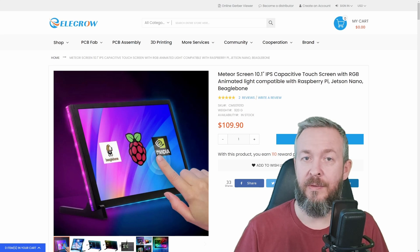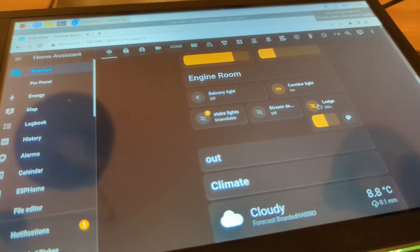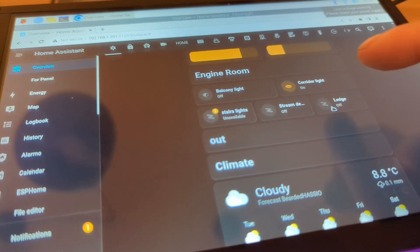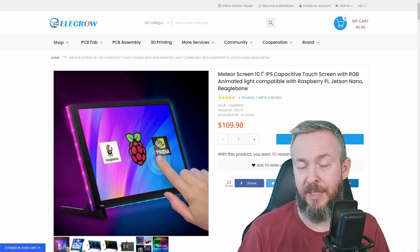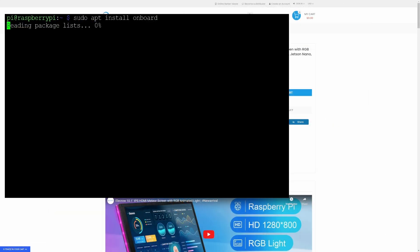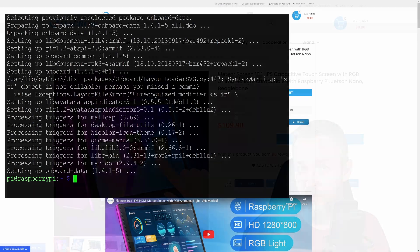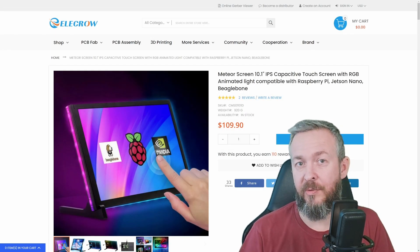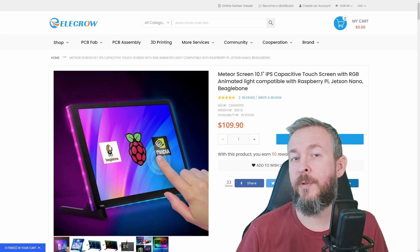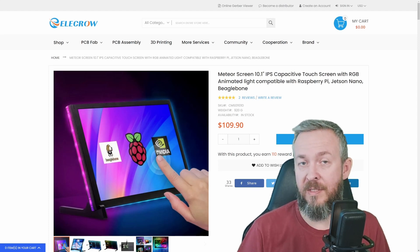I did manage to run this display with the Raspberry Pi Zero 2 W and it loaded up nicely. If your intention is to use the display with Raspberry Pi OS, it will work out-of-box — the touch functionality, even the long-hold or right-click option, yes, out-of-box. The only thing you will need to install is some kind of keyboard. Installation of the drivers is really easy. I always go for one particular option — it's easy to install, requires no external repositories, and when configured, offers additional options like auto-popup and always-on-top that make life easier with the touchscreen.